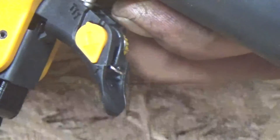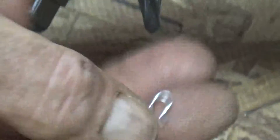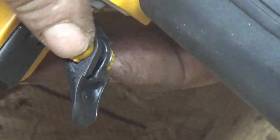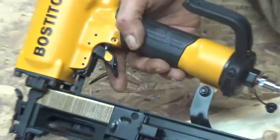The staple gun comes with a single or multiple shot switch. You can only change the setup if you remove that little spring splint. Be careful when you move that splint out, because it's very very tiny — and if it's gone, it's gone. There's only one in the kit. After you remove the splint, push from the back side and then turn the switch to change the setup to multiple shots. Put the splint back in and it's ready to use.